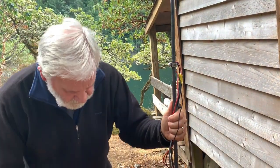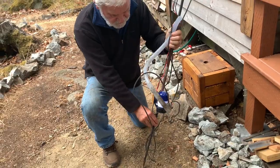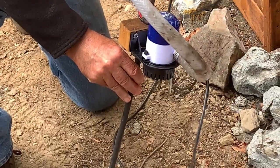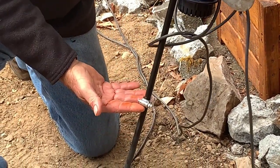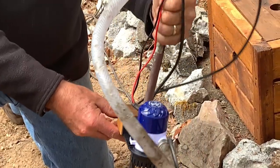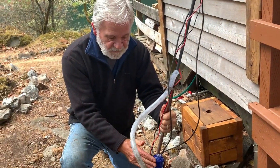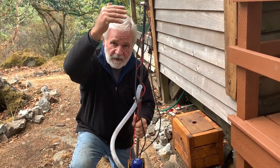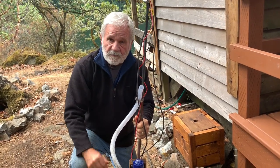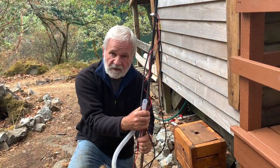Here's how we address the problem. We built this small unit that we stick inside our water tank. It's mounted on a steel rod, mounted on a sleeve, so we can slide it up and down when we set it inside the tank. We simply adjust the hose clamp, depending on water level. The bilge pump — which you can pick up at a hardware store or a boating store — is just 3 amps and is connected to a rubber hose. When we set it inside the tank, it jets water into the top of the cistern, and as it falls down, it aerates the water. We use this thing about an hour every other day or so, and it makes the smell go away.